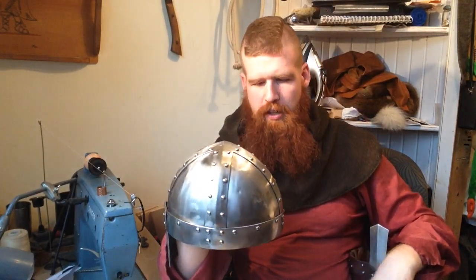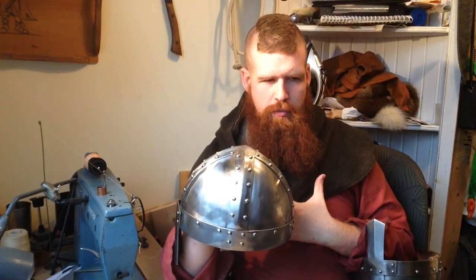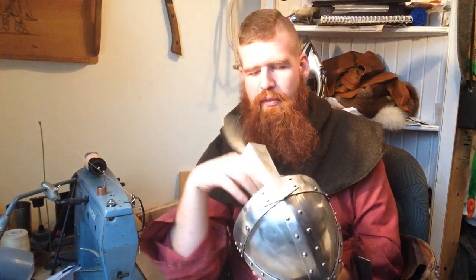It's just not getting cleaned up after that. But you know, he'll go over it with a rust eraser and it'll be perfectly fine. But it gets all scratched up anyway. So, in my opinion, there's no point in polishing this kind of thing up anyway. If anything, I would apply some kind of a darkening agent to it, whether it's a bluing or a blacking, or even just putting warm vinegar on it to give it a darkened etch. Even that might be a good thing to do. That'll take away from the kind of machined look of it.